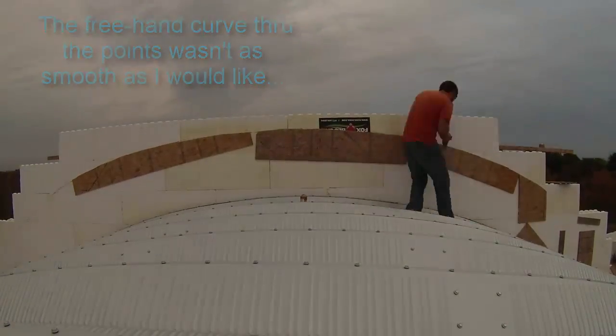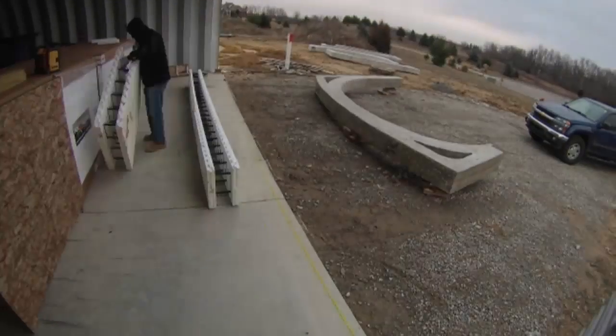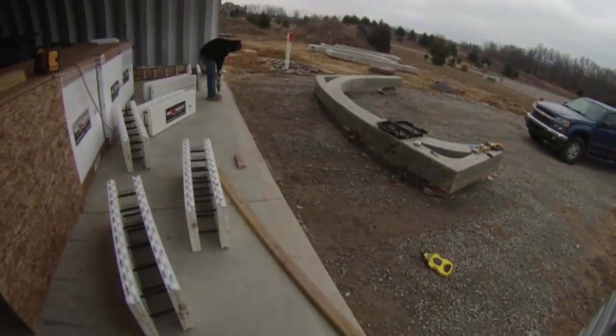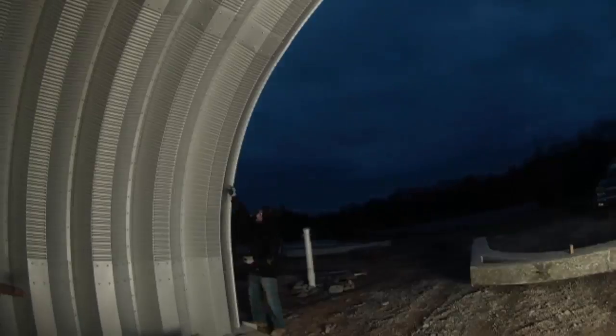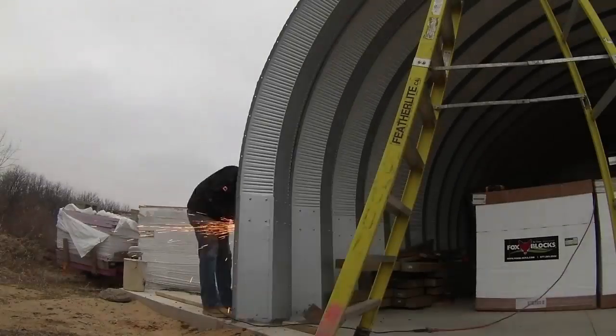The jigsaw cuts only half the blocks, so those black bits are the inside of the other side of the blocks. I started the south wall by laying out some blocks to figure things out and screwed in some kickboard so the bottom of the wall would stay put. The Quonset hut wasn't quite straight, so I set up my laser and marked the front of the Quonset hut for trimming. It cut easily with the grinder. I think it was Aaron's idea to cut these tabs for attaching the ICF blocks later.